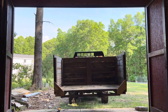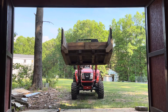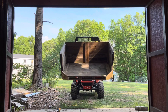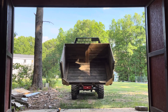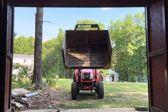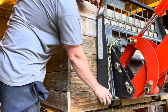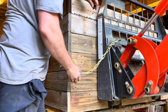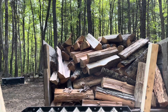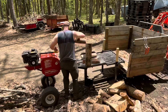Here it is after I widened it — I went from five feet to six feet, and I also fixed the back. There is one important thing you need to keep in mind with these kind of dump boxes: you need a way to keep it from sliding off your forks. I simply use eye hooks with a safety chain on each side. That prevents it from sliding off and keeps it safe.